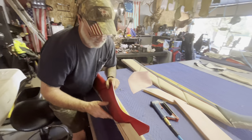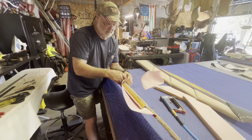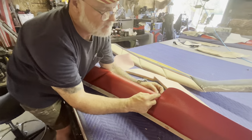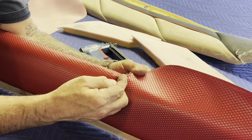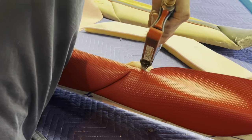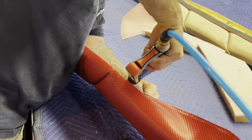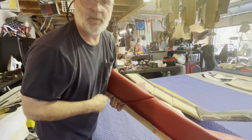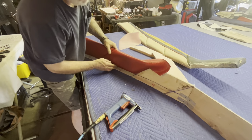and then how you do this is I cut it real tight because I've been doing it a while. But what you'll do is you see this right here. Instead of having that fold over and have a single edge, I like to roll it. See that? And it just covered that staple. That's experience. You'll get it. And then you come down and you pull towards you on this end. See that? See that? Flawless. And yet you still have the pocket to where you can hide the screw to affix it to the bolt. So then we've got that in.